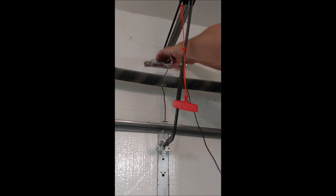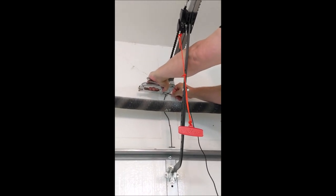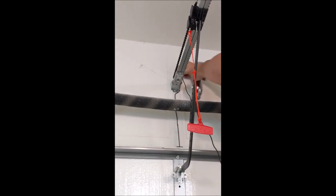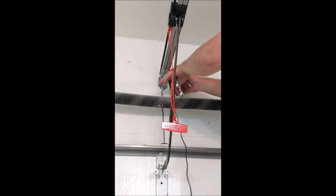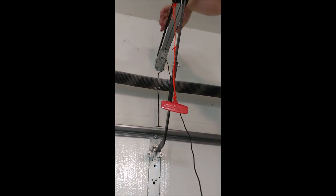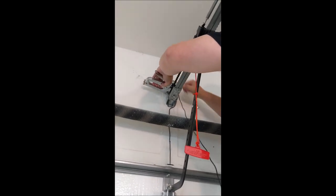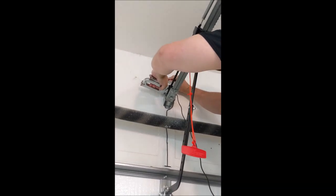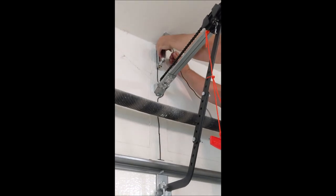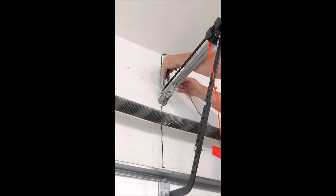Now you want to be very careful with your corner stapling. What I normally do is I make sure it's slack on both sides, put the staple in so it's not going to hit the wire, then pull the wires tight and it'll hold it in place. I'm going to staple that — that's just to make sure it doesn't ever pop next to this chain up here. You don't want it popping up next to that. This was all hardy wood, so the staples will stick to that pretty good.